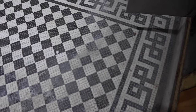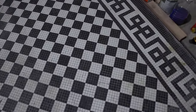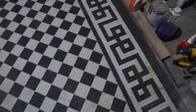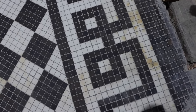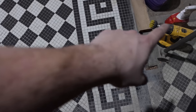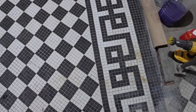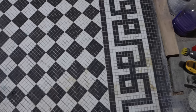Before I cleaned everything, after. And it's looking quite a bit nicer. And one thing I want to point out about this floor is there's a lot of staining going on with this kind of yellowy color. It's kind of all over the place. Now, the best way I found to get that out is actually with a drill with one of these little brush attachments and Barkeeper's Friend. That stuff is the only thing I found really that does a pretty good job of cleaning this up.